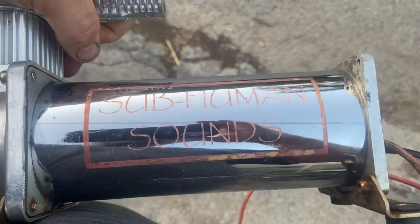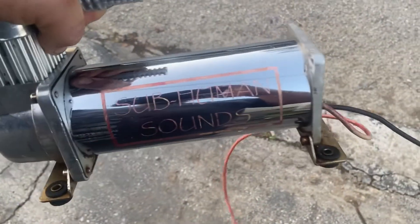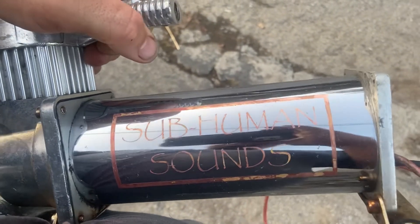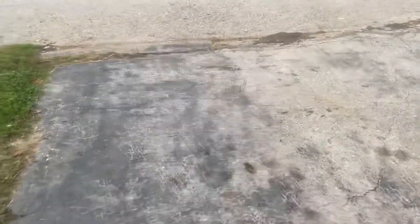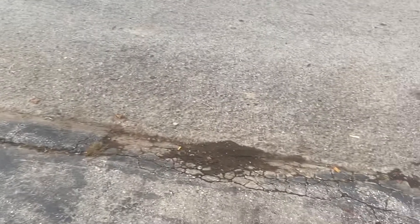Most likely this will end up going on that S10 over there, the one I've been working on. And that's the process: just make a stencil, get the stencil placed on, use a saltwater solution, positive on the case of the metal you're etching. The shinier the metal, the better. I don't know how it would work on aluminum, but it's just kind of a rapid oxidation — the electrode just speeds the process up in that spot.